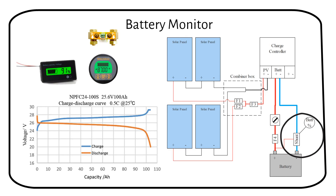You will also notice a small red wire leading to the positive of the battery. Its role is crucial — it measures the battery voltage to calculate watt-hours by multiplying the battery's capacity by its voltage continuously. For accuracy, this wire needs to be positioned as close to the positive battery terminal as possible. Modern shunts are equipped with a display or can connect to a Bluetooth app, allowing you to monitor the current state of charge of your battery easily.